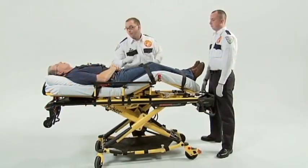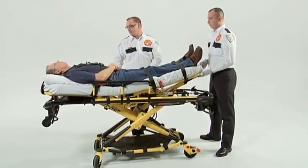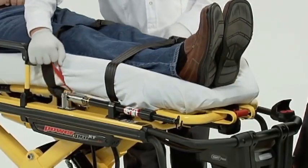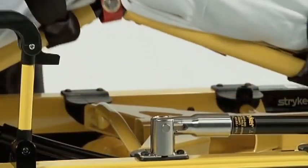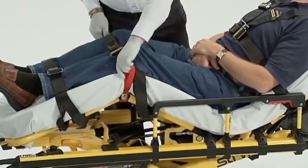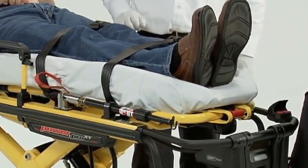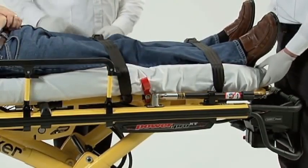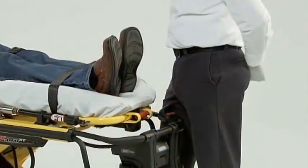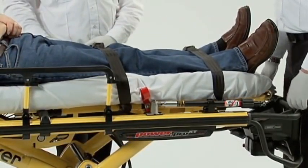The PowerPro XT also has an optional litter that allows a patient to be placed in knee gatch or Trendelenburg position. These features can be operated by one or two medics. To actuate the knee gatch position, simply lift one of the red lifting loops at the foot end of the cot until the knee gatch is in its fully raised position. Slowly lower the knee gatch to allow the support bracket to engage in the locking mechanism, and check to be sure the lock is fully engaged before releasing the lifting loop. To lower the knee gatch, lift either red lifting loop to relieve pressure on the locking mechanism, then actuate the red release handle until the lock disengages and lower the knee gatch to flat. To raise the footrest on the litter, lift the footrest frame until it stops — be sure it is securely locked before you release your grip. To lower the footrest, lift the frame and while holding it, actuate the red release handle and slowly lower the footrest to the flat position.